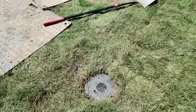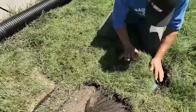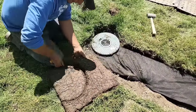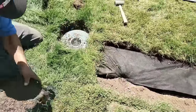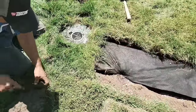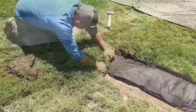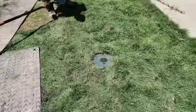When installing one of these kits, here's a trick for cutting the grass out: take a piece of sod, push it down on the lid, and it'll leave a lid imprint. You can then trace it, take your box knife and cut it, and you'll have a perfect piece that fits around your turf restrictor plate. Super easy — work smarter, not harder, that's our motto. Make sure your turf restrictor plate is at dirt level, or even a quarter inch below dirt level. You want to funnel all that water into the system.